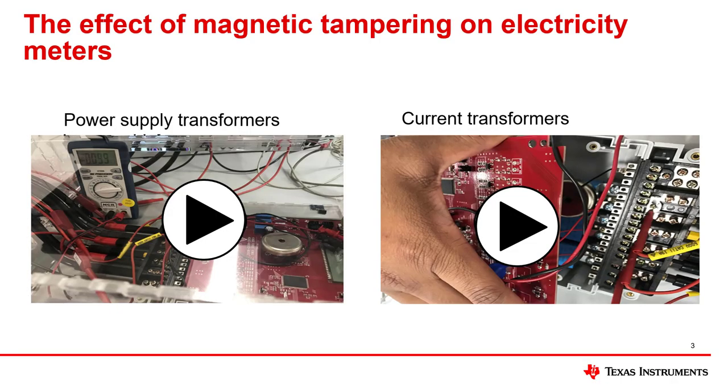In this video, a physically small-sized magnet is used to show the effect of magnets on CTs. It should be noted that larger magnets cause a larger drop in readings, and a strong enough magnet could even cause a zero current reading from a CT. In addition, multiple CTs could be affected by the same magnet, with the closest CT most affected. One method to deal with the effect of magnets on CTs is to shield the CTs; however, CTs can only be shielded to a certain extent, and shielding requires additional material and labor costs and undesirably increases the weight of the meter.